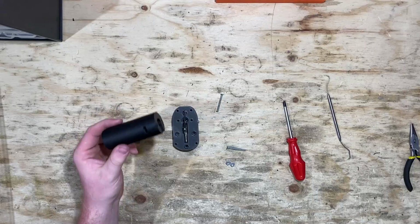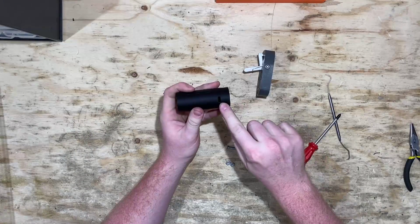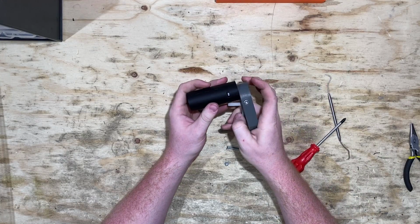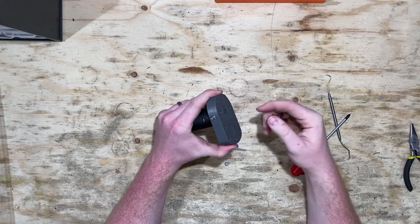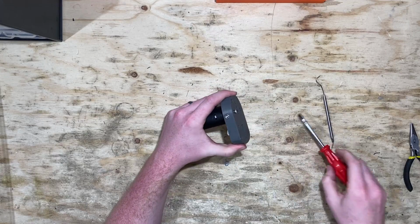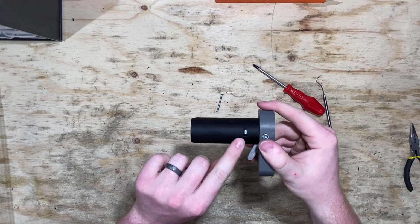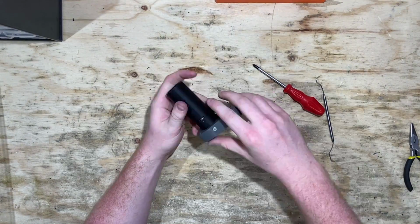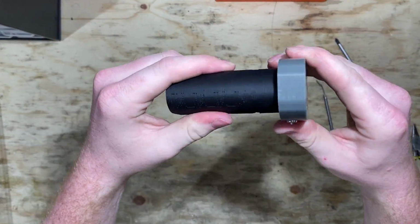Okay, now we're going to attach the spring guide to the base plate, to the back plate here. There's going to be these nuts in either hole. Make sure the holes are clean. And we're going to feed the screws through the back here into those nuts, and get those nice and tight. As you do it, you should be able to see the thread actually come through the nut there. And there we go, there's our catch mechanism.